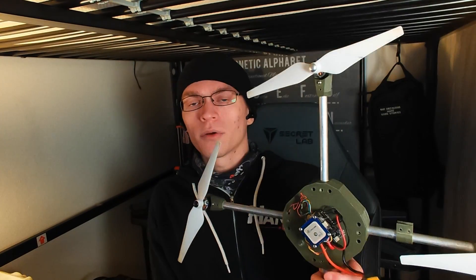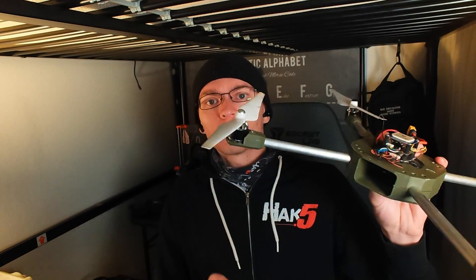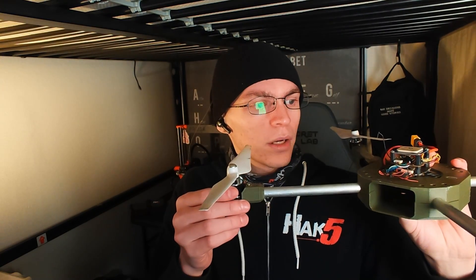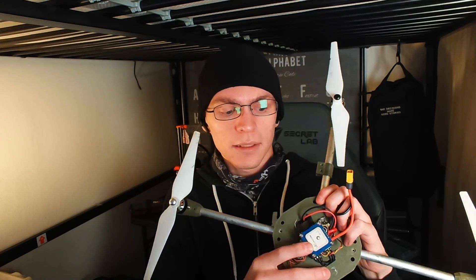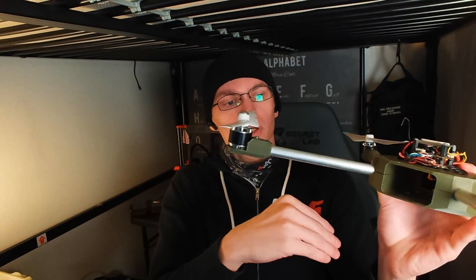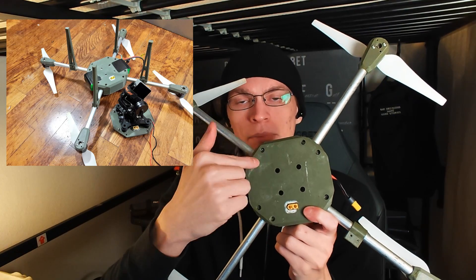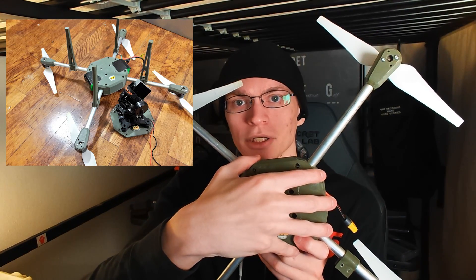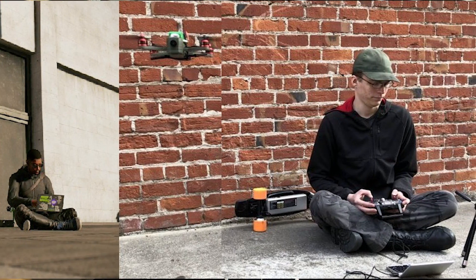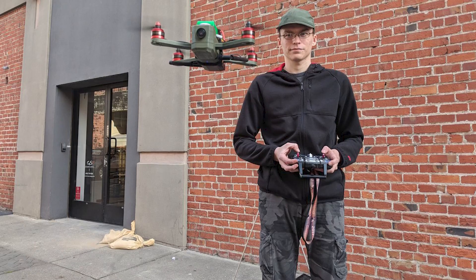We can also look at my other drone — I actually did a couple of videos on this one on my channel. I wanted to use aluminum arms to get rid of the arm-snapping issues. I wanted to have a full GPS stack on it so it could be fully autonomous. And I wanted the battery integrated into the core so it could slide right through, allowing modular attachments on the bottom — such as gimbal cameras, Wi-Fi pineapples, and so on. And a lot of you know the drone I designed that actually got me on Hack 5 in the first place: Project Cuckoo. That thing still has a soft spot in my heart.